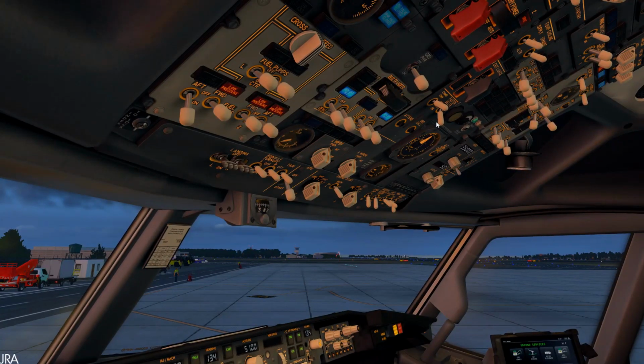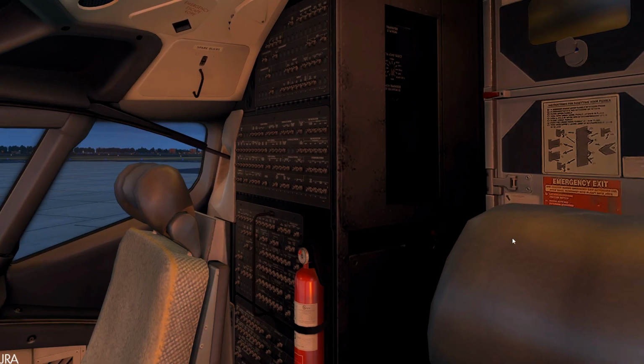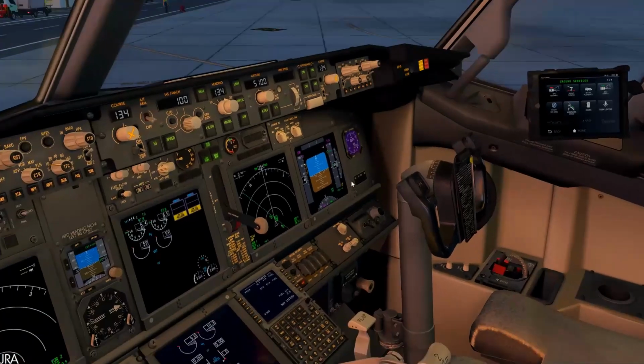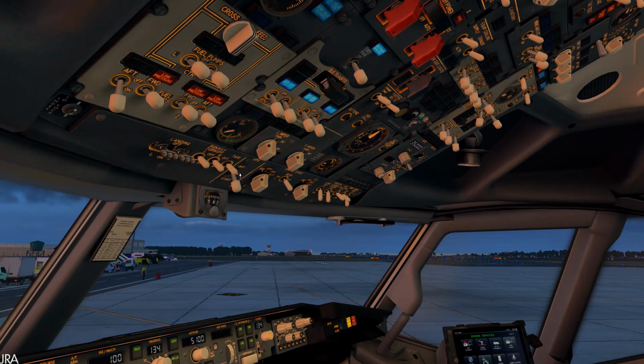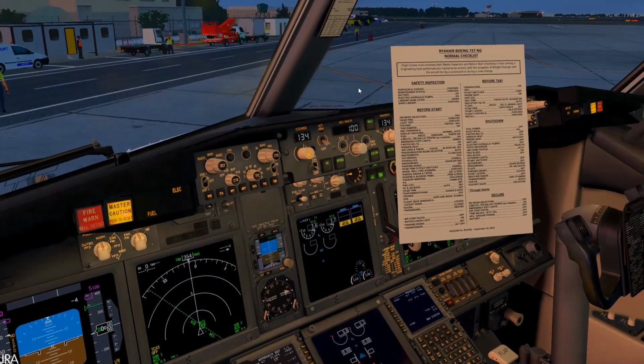Through 20%, anti-collision light off. As you see, the signs can go to off as well. We'll unlock the flight deck door. Good. Set of chocks and ground power. We can stop the block time then. GPU on, get the APU off. There we go. We can run the shutdown checklist.